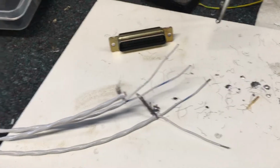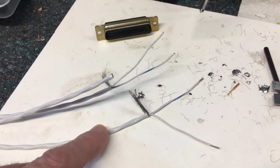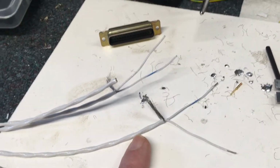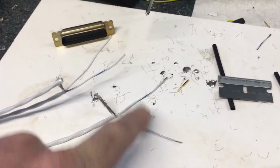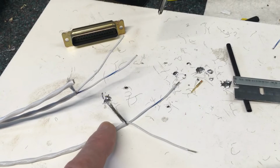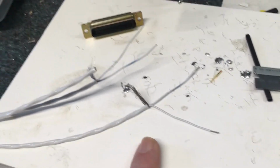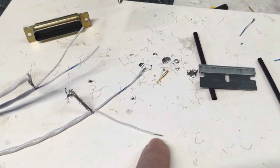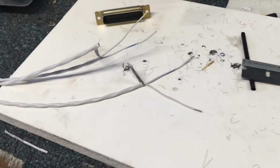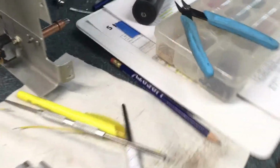And I looked online hoping I would find, somebody probably makes this, but this is 2 conductor twisted pair shielded wire. And that's really typical for doing this Garmin CAN bus stuff. So you've got the two wires for the signal in the ground, or whatever they call it, and then the shield for CAN bus. I would expect somebody probably makes this in 24 gauge, because I don't think it needs to be that big, but that's what fits most of the standard connectors. You'll want this 22 gauge, but then what do you do when you get to the 24, to the high density pins? So there's a question. What do you do with that? How do you transition over to that?